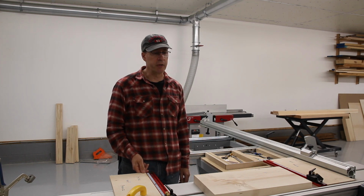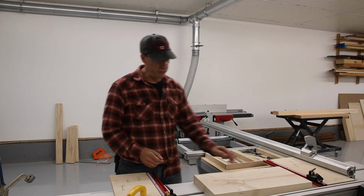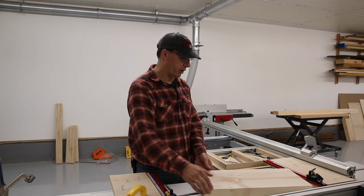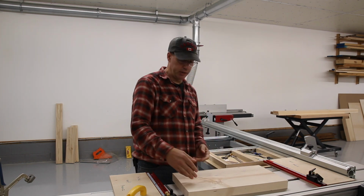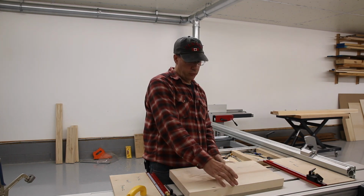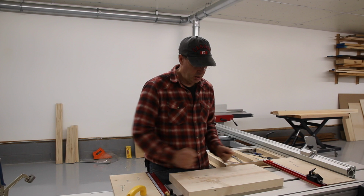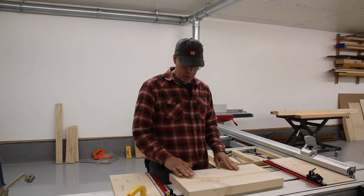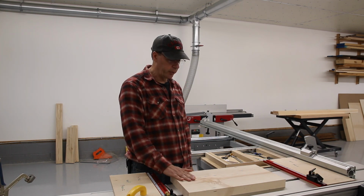And he was showing his frustration with cutting hard maple on a table saw, because often when you get hard maple, there's a lot of stress in the wood. When you cut a big white hard maple plank, let's say 10 inches wide, right in half, you've got 5 inches of wood here, and if there's a lot of stress it starts to pinch on the riving knife, and then it's almost impossible to push through because it pinches on the riving knife so hard. Not every board is like that, but maybe 30%. There's an awful lot when you go into hard maple.